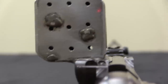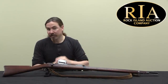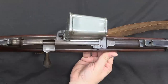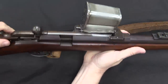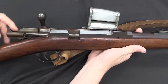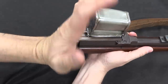It is however very similar to the French Gras. It uses the bolt handle root as a locking lug. But really the cool thing about this is the magazine. The magazine is offset to the left side of the rifle, so it can have centre-line sights, holds 9 rounds as I mentioned. The action itself is just a single shot bolt action, uses the root of the bolt stem as a locking lug in the receiver. You've got an exposed striker. Very similar to the Gras — it opens up like so, and it is a cock-on-close action.